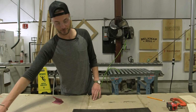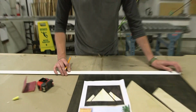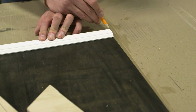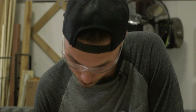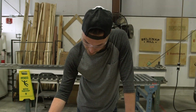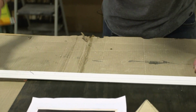So when you cut this, we're going 23 right to the edge of the wood. When you cut the 45s, they've got to go in this way, right? So you're gonna have one like that, and one that goes like that. But that 23 3/4, always make sure it's on the outside. Here's the inside of the cut, because if I were to measure this and it was here, it wouldn't work. So you just pay attention to what you're doing, and you'll see as we go along.